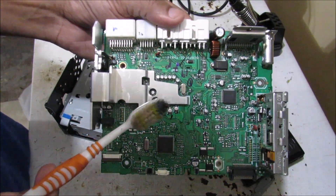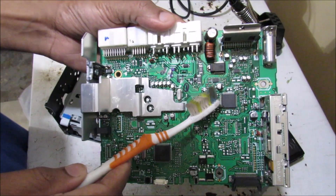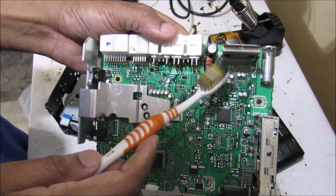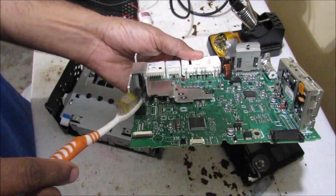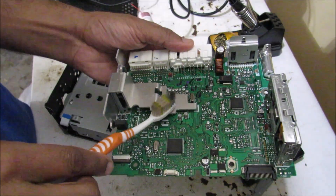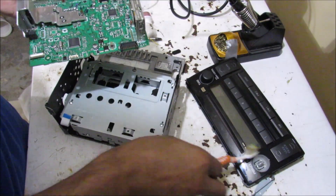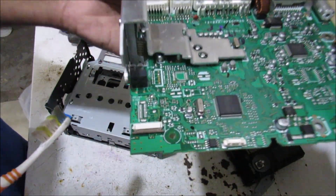Here's a quick overview of how this radio board works. You've got your digital sound processing chip which takes all the inputs from your aux lines, CD player, and radio, and feeds them through the amplifiers and out to the speakers. Under the heatsink there's another set of transistors and a processing chip. Over here is the chip that controls the interface — the buttons and LCD screen — and the ribbon cable that attaches to the CD-ROM.